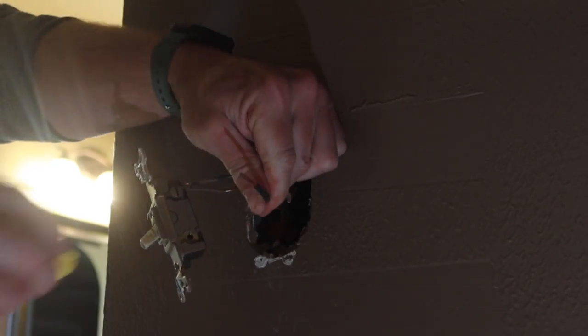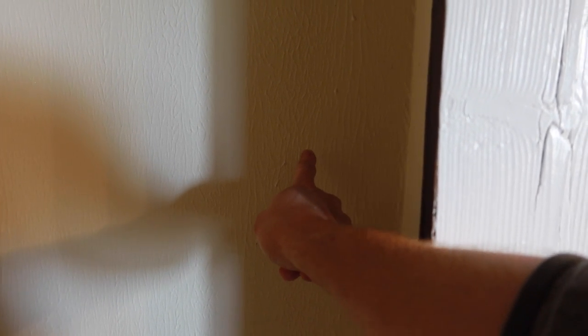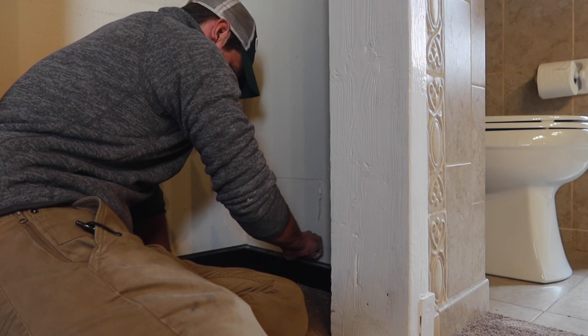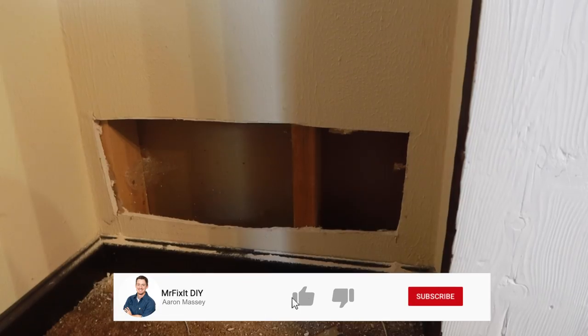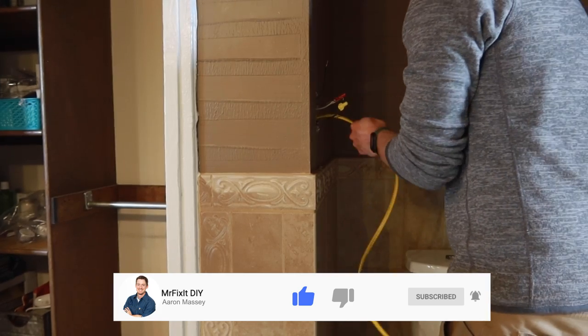I'll turn the power off. I'm going to take this apart and just put a wire nut on that line wire so I know that's the line, and then I can tap into that when I need to. The light switch is roughly right here on the other side of this wall. I'd like to put the receptacle a little further back by the toilet, so I'm going to attempt to run a wire down the wall and cut the drywall across down back here, then install a receptacle back there in the corner. I'm going to try to save this piece of drywall and put it right back in where I took it out. If there's blocking in this wall, it might be a little difficult, but we're going to try that first and see if we can drop a wire from that switch down to that opening.